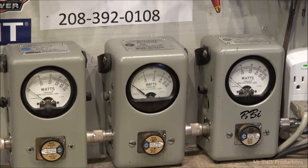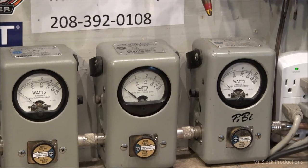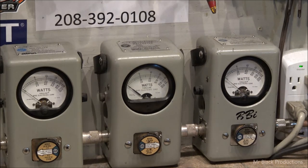So we got a 1,000-watt slug here, 1,000 in average, 5-watt slug in reverse. Remember, we were doing about 9 and some change, barely squeaking up there to about 9 and some change, right? Check this out. Same amount of drive. I better show that to you, too, or otherwise somebody's going to call foul. No BBI. Oh, yeah, I don't even have the power supplies on down here. Hold on. Here, now we're putting our whole 20 watts worth of whopping drive into the thing. Thousand watts. No problemo. Now let's go over to sideband.